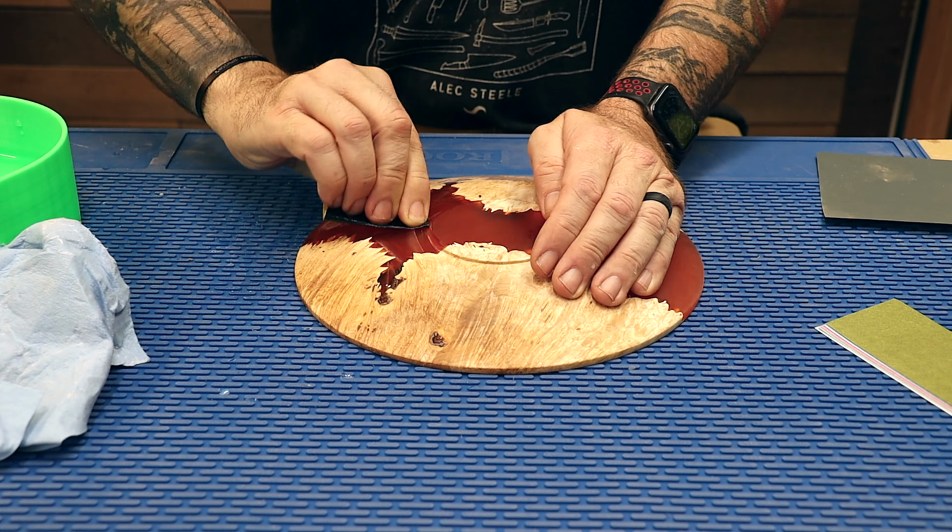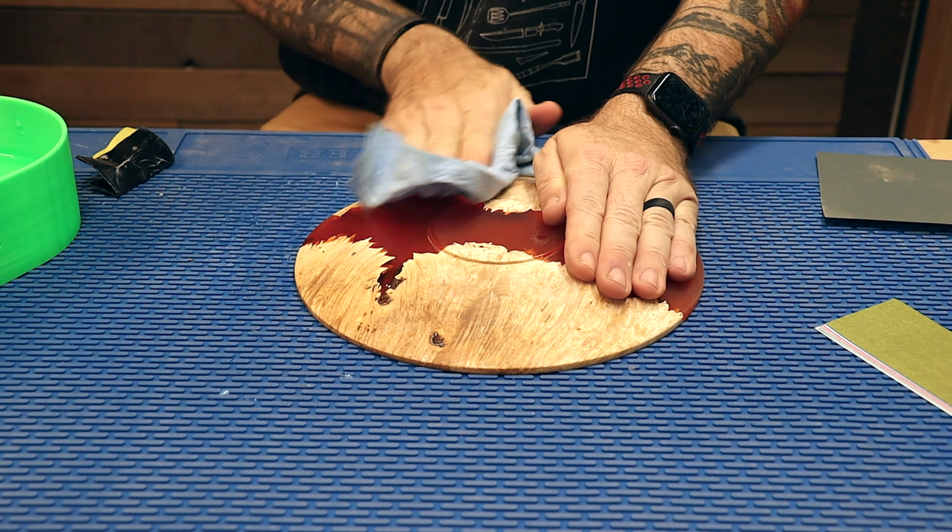I'm going to be wet sanding here using some 600 and 800 dry wet sanding paper, and then you'll see there I've got the Zona paper out, thanks to Zach over at Envy Woodworks for turning me on to those. I got those at Turner's Warehouse, not sponsored, I paid for them, but man, do they do a really, really good job.